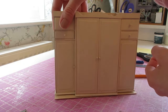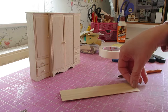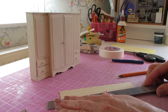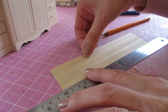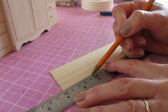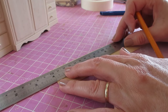Remove the wardrobe and draw a line one millimeter in front of the pencil lines at each side — place your rule just about a millimeter in front of those and draw a line lightly along there. Then measure from the outside edge to your internal pencil line at the side of the central part — I make that 45 and a half — then take off that millimeter and do a pencil line at 44 and a half. Do that same pencil mark along the back edge.